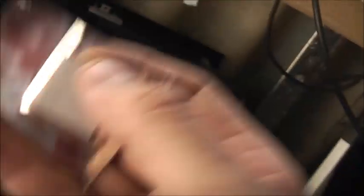It wasn't getting cooled effectively, and it slowly just until recently fried itself — got too hot and burnt out. Because this heat sink wasn't adequately placed firmly on top of the BGA chip. So the BGA chip in this TV is fried.